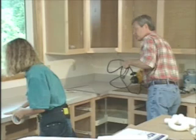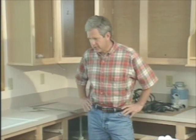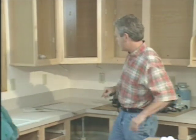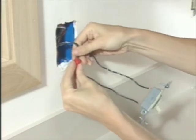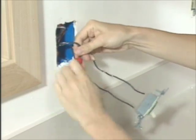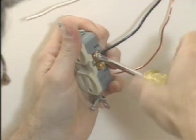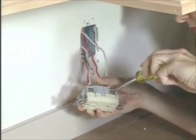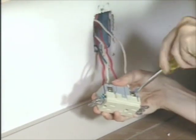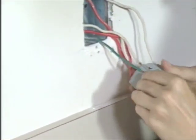We'll get to the plumbing in just a second, but first we want to bring up the speed on some of the electrical we've done here since we finished the floor. All the GFI switches are in, so now we can hook up our appliances. The dishwasher and disposer are on dedicated circuits. The dishwasher is hot, whereas the disposer, once we plug that in, will be operated by the switch up here. We ran the power first through this box and then down to the receptacle, so adding the switch gives it control over the circuit. Most of the receptacles we put in were normal 20 amp devices, like this one for the refrigerator, and that includes the dishwasher and disposer outlets. Most codes now require GFCI protection on all countertop outlets, so we installed GFCI devices at the start of our countertop circuits and ran the other devices off those to give each of them the same GFCI protection.